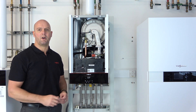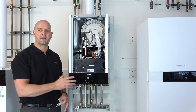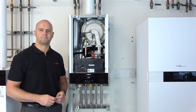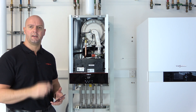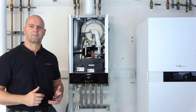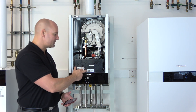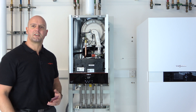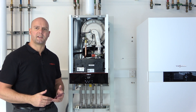For today, we need AP mode so we can connect our mobile device to the boiler. I'm going to show you using the app how you can connect your phone to the boiler, ready to start the commissioning and adding the Vcare thermostat. We'll put a screenshot in the video so you can see my app on my phone as I go through the commissioning, step by step. We've already logged in with our IAM account on the app, and we've got access to the QR sticker. The boiler is all ready to go for commissioning and it's in AP mode.